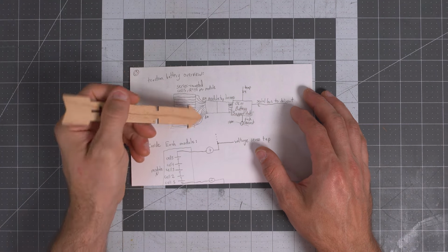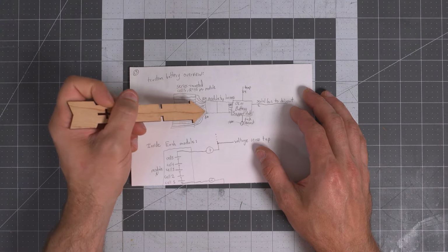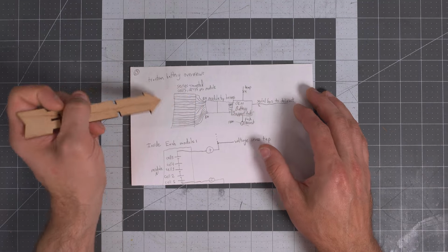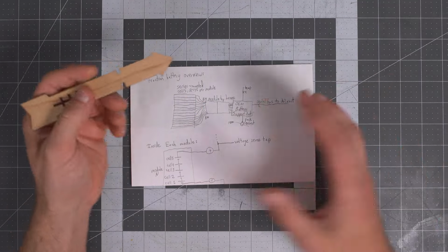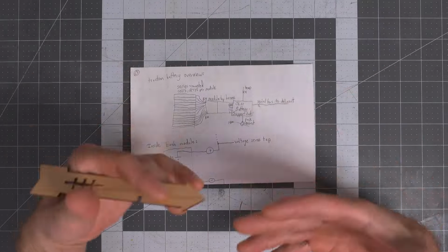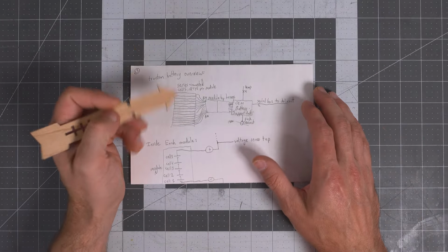You have these B0 through B14. They're tap harnesses, so they're basically periodically measuring after 5, 10, 15, 20 cells with NexCell, or with the OEM one, I believe it's every 12 cells. It doesn't matter. Just the voltages between nickel metal hydride and lithium are different. Nickel metal hydride is around 1 volt, lithium iron phosphate's 3 to 3.6. So anyway, you end up having fewer cells in between.